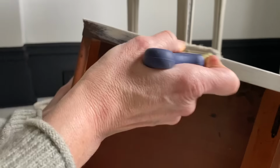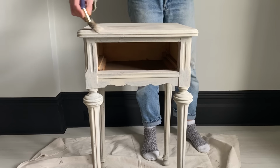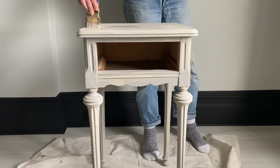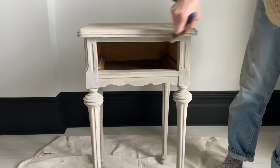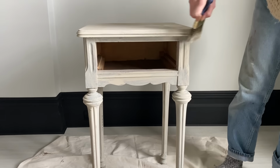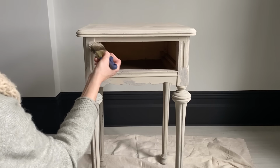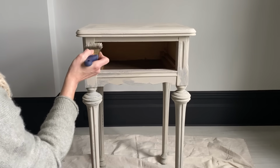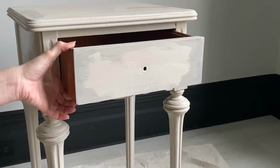From my own personal experience, when I'm painting in the cooler months, because it's wintertime right now, even knowing I have the heat on, it's still cool in the room that I'm working in. So I find that the paint will kind of stagger out about how fast it's going to dry. That interrupts it a little bit, and I always just find it a lot safer to go ahead and let that dry. If it's a super warm room or you live in a warm climate, you can probably just let it dry in a couple of hours after 2 coats.